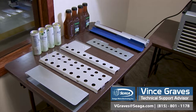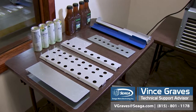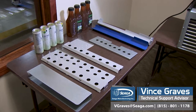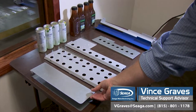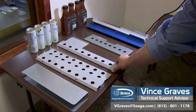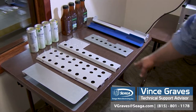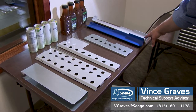Within your beverage lanes, you have several options for spacers and shims depending on the product that you're vending. Here we have all of the available shims and spacers: starting with our back spacer, our large side spacer, our small side spacer, the right side spacer, the auger insert, and the auger that it snaps into.